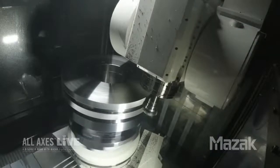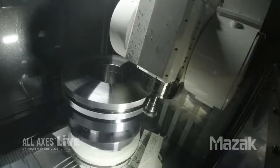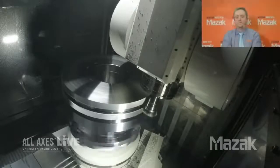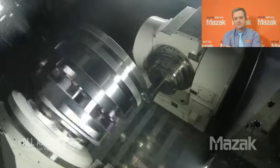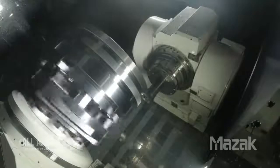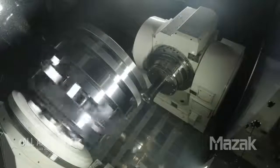The Smooth Gear milling software works with the rotary scale feedback of the milling spindle and the turning spindle to enable the proper RPM for power skiving operations. But when using a machine like this, you also still have the capabilities of the other Integrex machines — you can still do 2D turning operations, 2½ up to 5-axis milling operations.